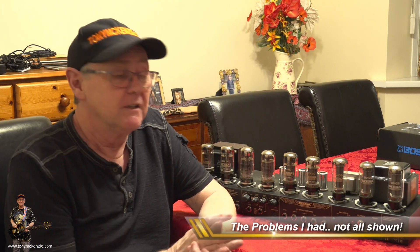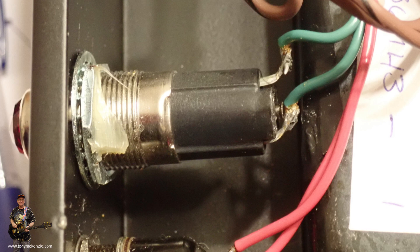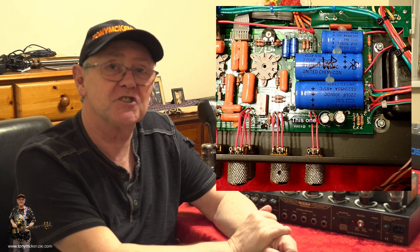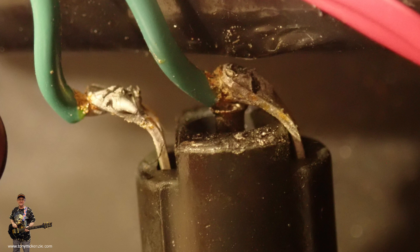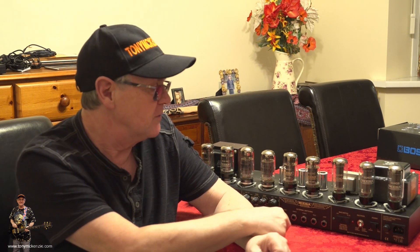Did I have any problems? Well, sort of. You know the on/off light at the front that glows? When you fit the new transformer, it catches on the wires for that lamp. If you don't move them out of the way, capacitors will warm up pretty quick. We saw it really quickly, turned it off, and checked the cap - it's all good. But this little capacitor did overheat. There's a picture on screen showing the lamp supply as the transformer supplies it. Bear that in mind since this is a slightly different transformer.